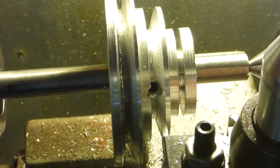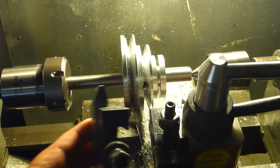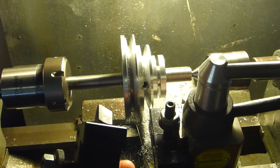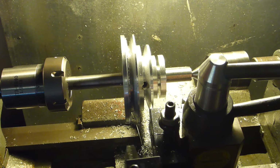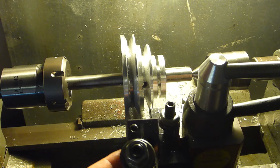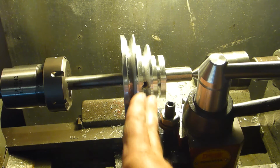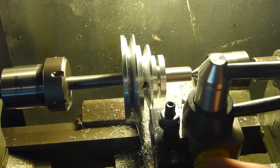There was one Doubleboost idea that just didn't work on my lathe, simply because it bogged down too much. I did go ahead and grind, which is what he did, a special piece of tool steel to try to just plow in there, and my belts are slipping. I've got to work on that. But for right now, this was not doing it, so I reverted to coming in at an angle. I put the parting blade back in.